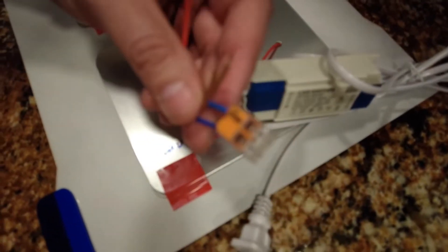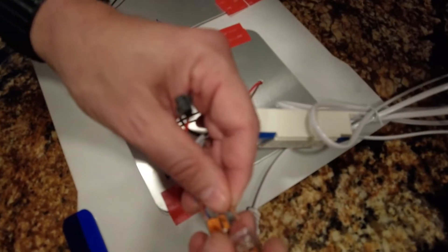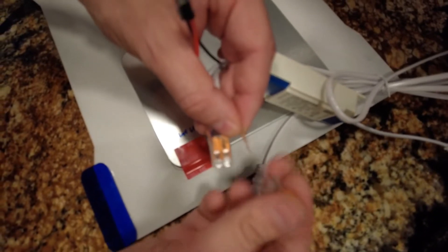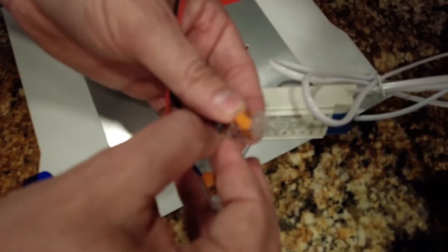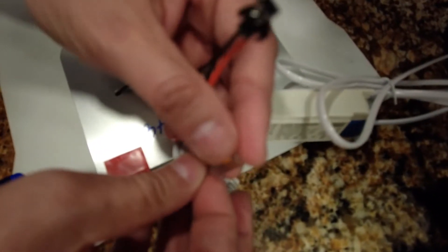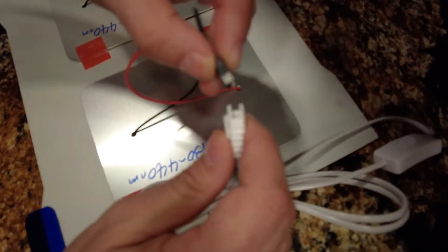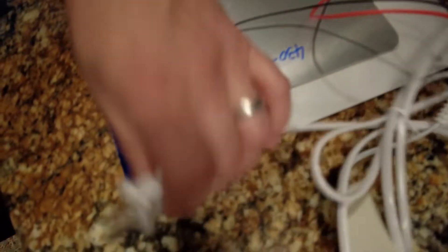You can see the example: blue on one side, blue on the other, then brown to brown. Using the lever nuts, put the wire in — you might have to twist it a little tighter if it's frayed. Push it in until it stops, flip it down, and make sure it doesn't come off. Do the same on the other side, push down firmly. Then plug the LED driver into the LED array and make sure it's snug.